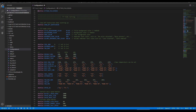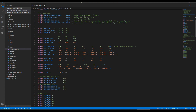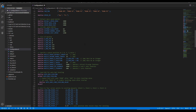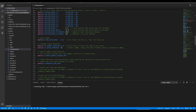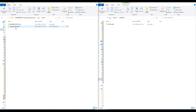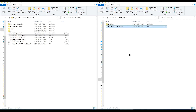Very importantly in configuration.h we can tell it if we have more than one hot end or extruder, change all of the preheating values for the hot end, the manual movement speeds, and the manual extrusion and retraction speeds. If you've got a filament run out sensor going through the TFT you'll want to set the size of your machine and those parameters as well. Auto bed leveling is available and turned on by default, but you can uncomment it and play with the manual leveling points. Just like compiling Marlin, we tick Compile and a firmware binary file will be created. We can then find the binary in the .pio folder inside Build, copy it to the SD card, and reflash the TFT.